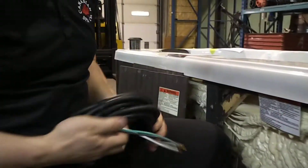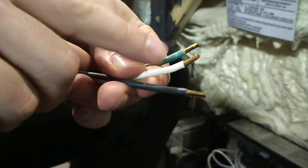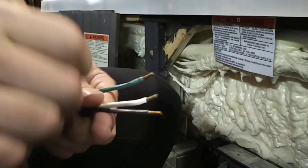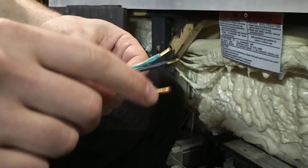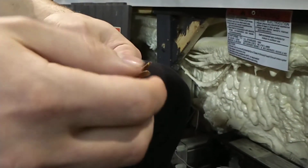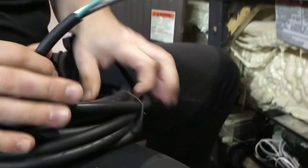This is a large, thick cord. What's nice about this one, these actually have what are called shark tooth connectors. These pinch the wires together so none of the wires can actually spread out and fray. What that does is it helps to make a tighter connection when you put that into the terminal block, so you have no loose wires. When loose wires can come out, they can potentially leave a chance for arcing, and that can cause frying and burning in the board — you don't want that. So these shark tooth connectors on the end help keep the wires all tight together so you make a nice solid connection. It's much safer.